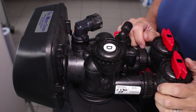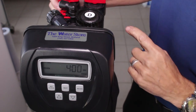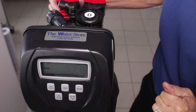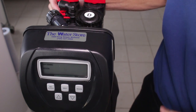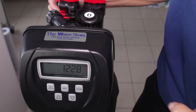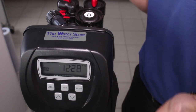Once you've tightened it, you need to put the unit back into service. Go to the front of the valve and press the regen button to advance to the next cycle. Once it starts counting down, press it again to go to the next cycle. Now it's heading for the fill cycle — wait until it starts counting down, press it again, and this takes it back to its home position. You'll notice it displays the current time once it's at its home position. Then put it back into service by opening up the bypass, and press the regen button to initiate regeneration at whatever time it's programmed for, usually two o'clock in the morning.